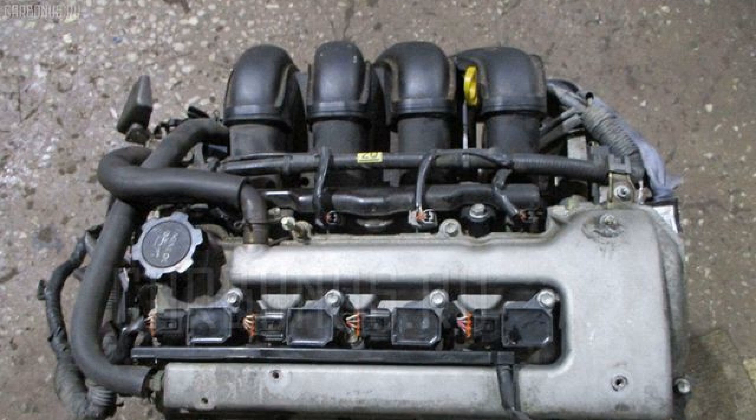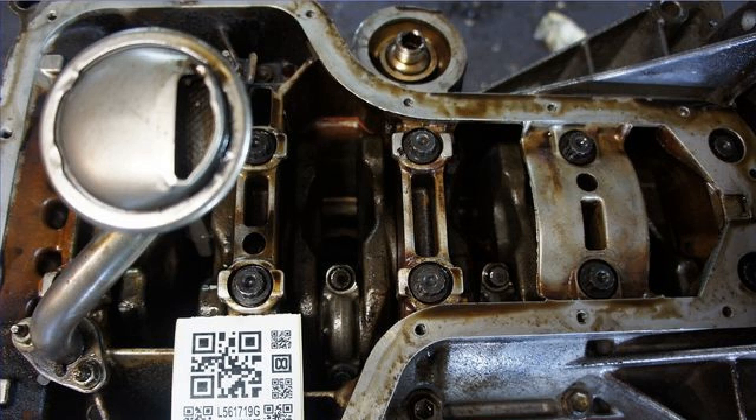To maximize joint strength and improve heat dissipation, the outer surface of the liners was roughened. As a result, the 1ZZ engine weighed about 100 kg, lighter than similar units by about 30 kg. To simplify production and to make it possible to use molds when casting the block, an open cylinder cooling jacket was used. If you look at the casting from above, between the body of the cylinder block and the liner, all around the perimeter, there is a gap deep to the bottom dead center of the piston bottom. The advantage of this design is that it is easier and cheaper to mass produce.